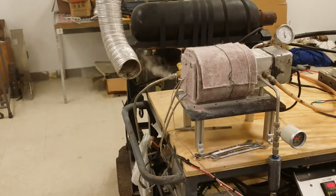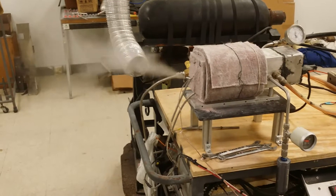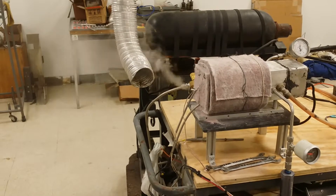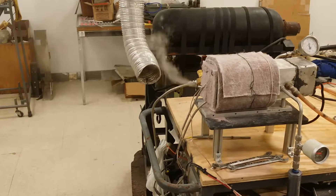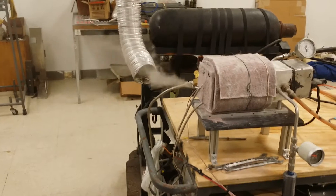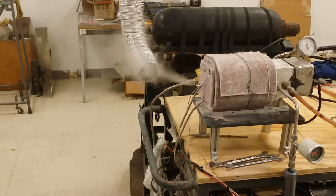You can see how much energy is being released here per injection. It's running at five injections a second. So you can imagine if you had 100 or 150 of these things in tandem, you could produce quite a lot. The pressure relief valve in here is set at 1500 PSI, so you're getting pressures in here that are well in excess of 1500 PSI momentarily.